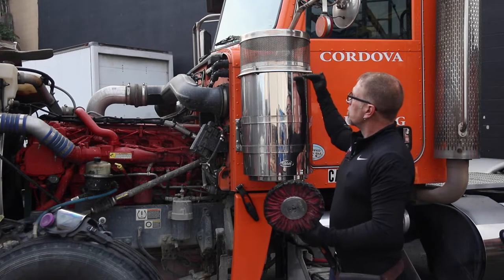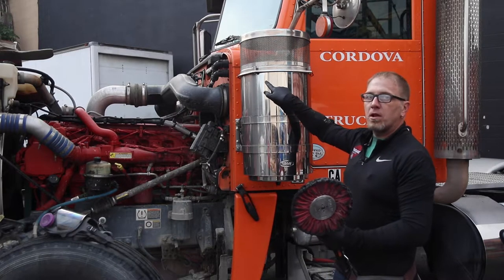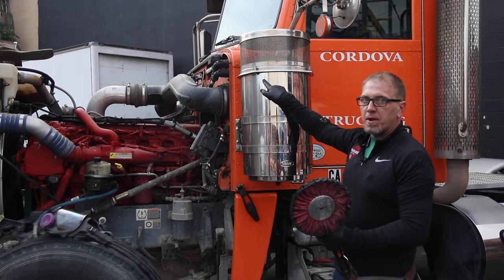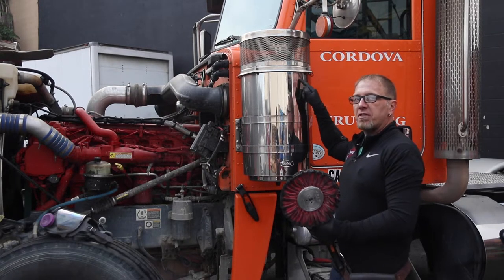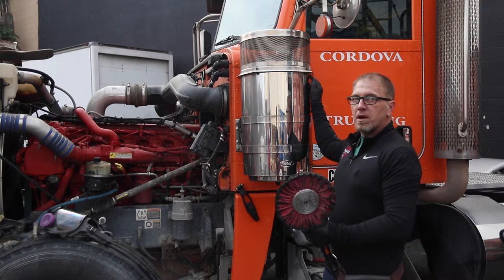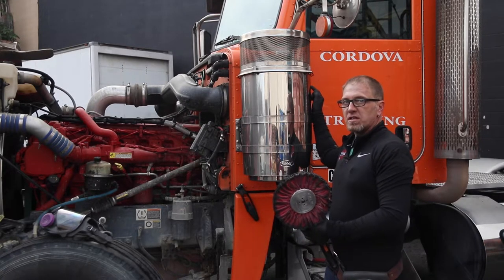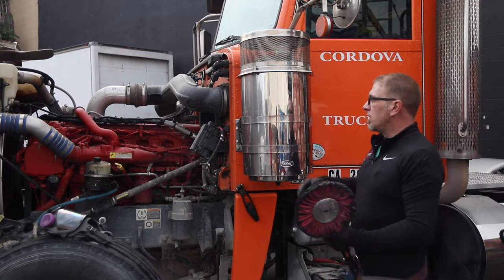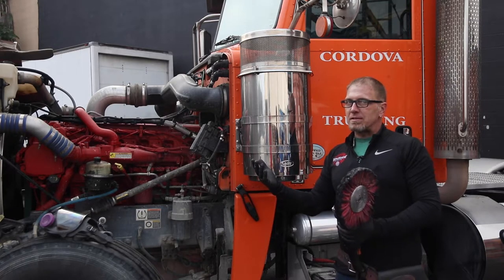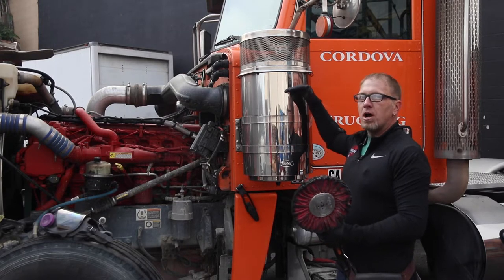With stainless, we're going to push over, then run our black compound line. Underneath that black compound line will be a grease line. We're going to come underneath our compound line and buff off that grease line. Then we're going to move up a little bit further above our compound line, lay another compound line, come below, and buff off our grease line. It's a rectangular pattern. That's going to allow the proper amount of heat transfer. Heat rises — that's physics — and that's going to allow proper heat transfer as you're moving upwards in the part.